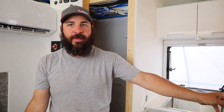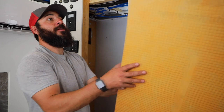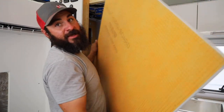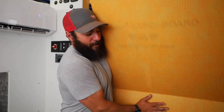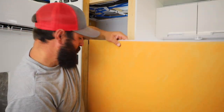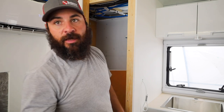Here's a trick that rarely has to be used, but in this case it does. We've got our piece of KERDIBOARD that has to go through a hole that's this big, and there is no combination of ways to get this thing into this bathroom. So what you do is take your razor knife and along the back of the board — not this side but the back — you scribe halfway through the material in a straight line, then go ahead and pop it. We can fold it now to get it into our bathroom, and once we're in, we can simply unfold it and install it. You could do that two or three times if you had to. We've kept a continuous face — the outermost face is a continuous waterproof membrane. We did have to cut through the foam, but we didn't cut through the membrane, so we're still fully waterproofed. That allowed us to get our material into a smaller space, so it's a good trick to know.